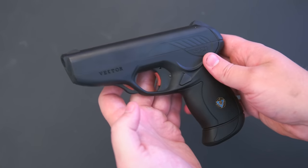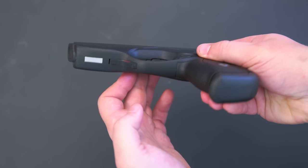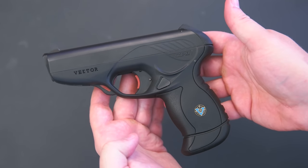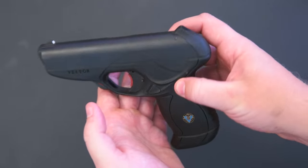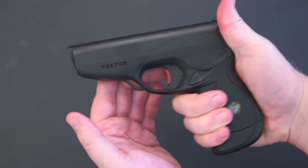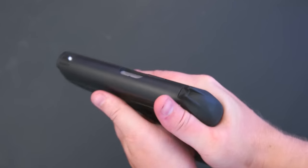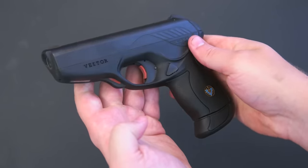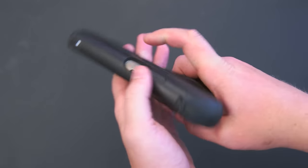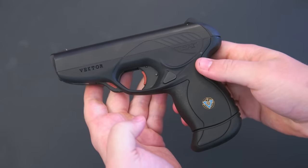The CP-1 is a double-stacked 9mm pistol with a hammer-fired, single-action only trigger action. It may look like a striker from the outside — I used to think it was too — but there's actually a hammer in there, which I'll show you shortly. The frame is polymer and feels to be of good quality. Despite the cloud hanging over it from the safety recall and the polymer construction, it just really isn't the cheap tourist-style gun I was expecting. It has a solid and balanced feeling in the hand, and overall construction feels pretty good. The slide is steel, nicely milled and finished — this one has a black slide, though chromed slides were also available.